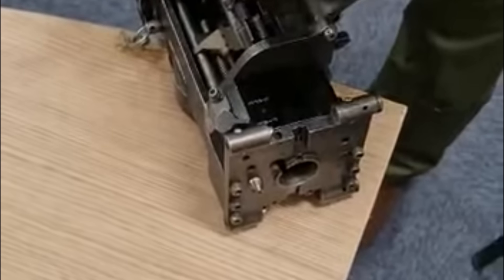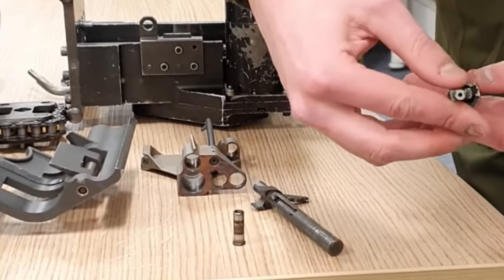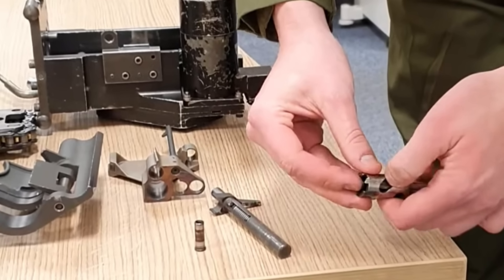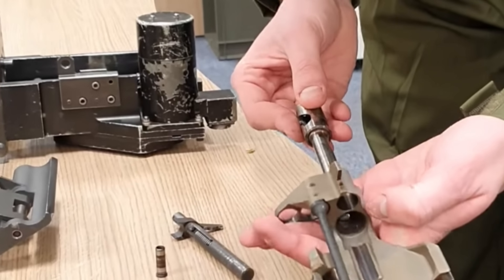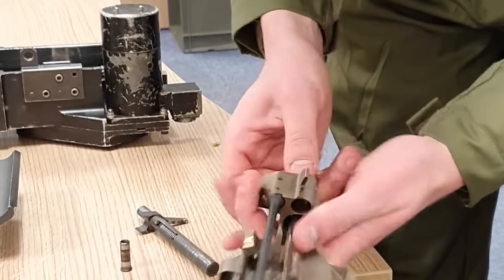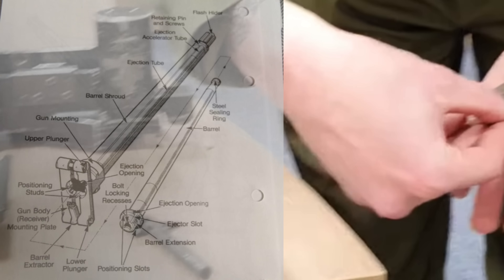But a lot of people say, well Matt, it's going to be difficult to change a barrel on an L7A2 compared to the chaingun - and this is another reason they didn't select it. The chaingun barrel could actually be removed internally to the vehicle, whereas the L7A2 barrel would be quite challenging since you'd have to pull the barrel out from the front, which you can't do. However, pulling a barrel out from inside a vehicle is also extremely dangerous. It's red hot. We had a number of crew members burnt trying to extract a red-hot barrel using Kevlar gloves or asbestos gloves, and it was really dangerous if you had a mix-match of barrels.